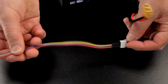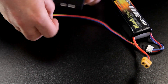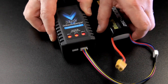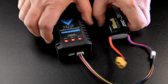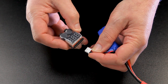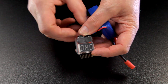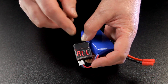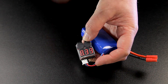What I do is use a balanced charger extension cable — I'll put links in the description — so you don't have to have the battery crammed right up against the charger. Some batteries physically won't fit onto the charger without an extension cable. Now let me show you a battery that's out of balance. Another little tool I use which is absolutely brilliant — a couple of pounds, makes a loud noise — it's an alarm that also measures individual cell voltages.